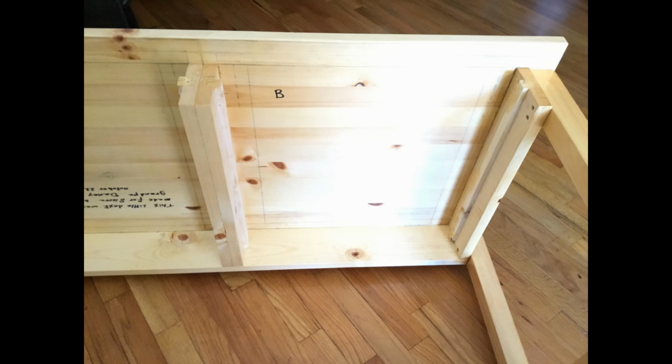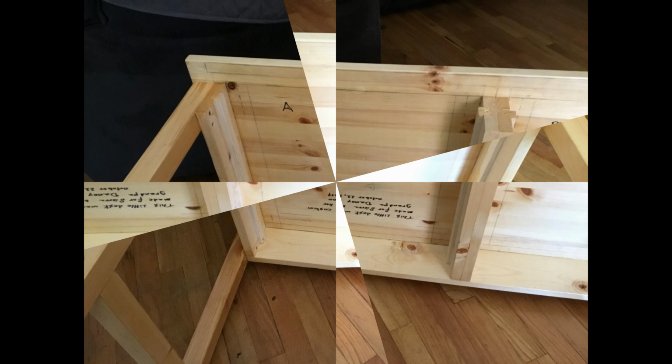Here is the underside, which shows these pieces that are glued together, along with the legs attached. It shows you one of the two locations where there are two screws, top and bottom, in the leg assembly, into that side drawer glide. There's a back panel across the back that's a stiffener, and then the two panels in the middle to hold each side of the drawer. And those little pieces in the middle are 3/4 oak drawer glides. It's a very old, trusted and reliable method of drawer joinery and functioning.